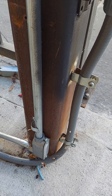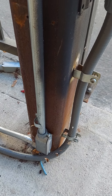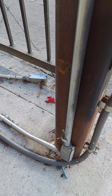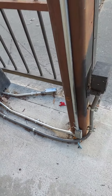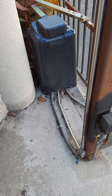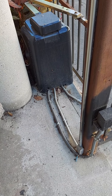Right here there is no connector at all for either one of these — it's supposed to be a rain-tight connector on both sides so that it's protected. This is the type of work that I see all the time that I have to go back and fix. This is not my job, but stuff like this is the reason why electricians get a bad rap.